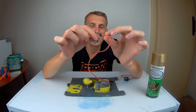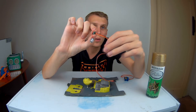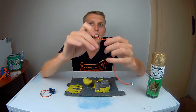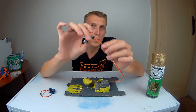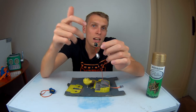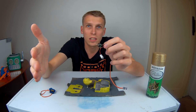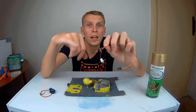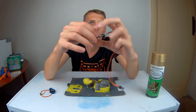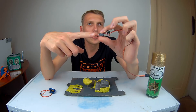These tiny little boards have very little power in them. Most servo motor boards are rated for 5 volts, and when you're looking at one of these tiny boards from a really cheap servo, if you put anything more than 5 volts into this board it starts overheating. When it overheats, the potentiometer reads values differently and the servo will actually swing around all over the place even when given a straight signal to stay in one spot. So that means this motor is capped out at running on 5 volts, and therefore capped out at the speed it can run.